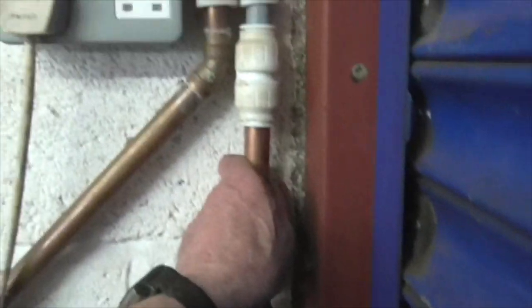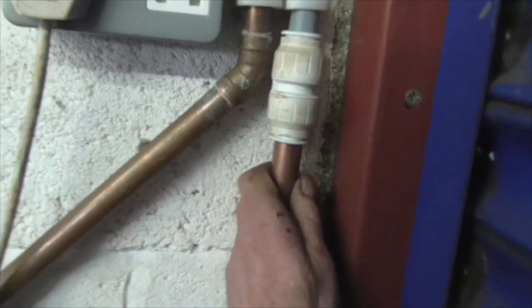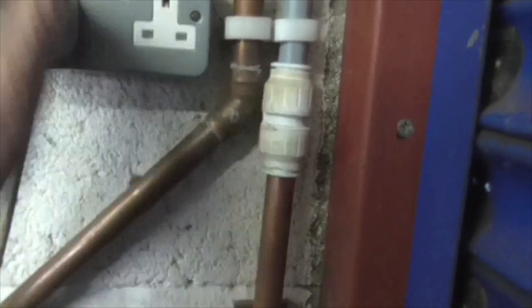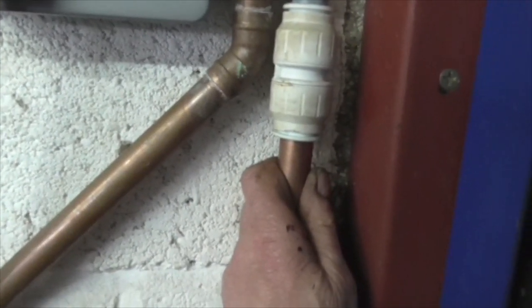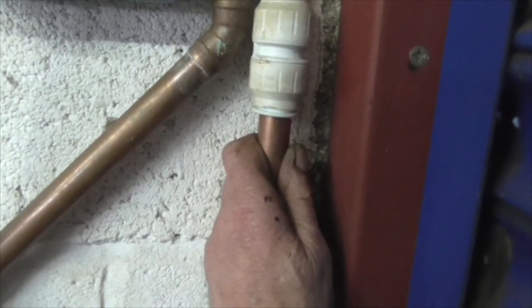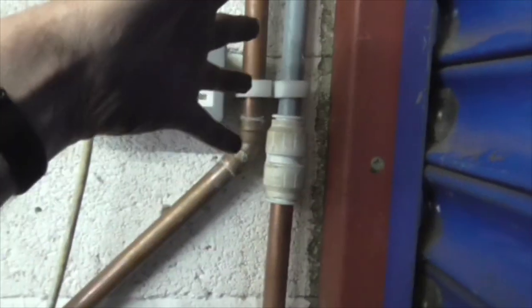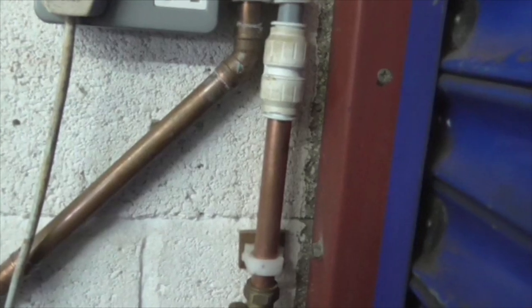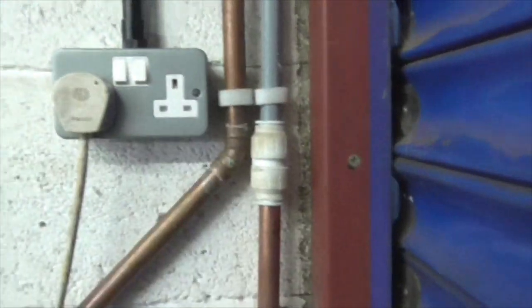And the strange thing is with this, when you turn the pump on, it over pumps, and then it cavitates, and then when you turn the pump off again, this piece of pipe where my hand is gets warm. And that's because the water is moving so far down that pipe under the pump, right? And when you switch the pump off, it rushes back up again to there, which tells me that one of these two pipes is blocked, right?